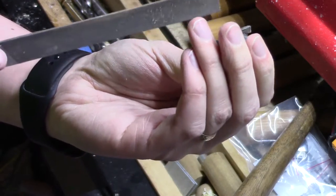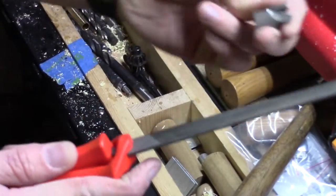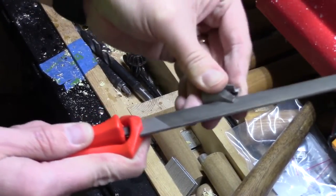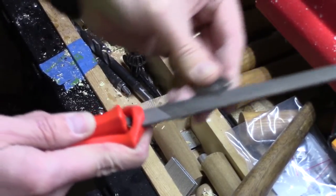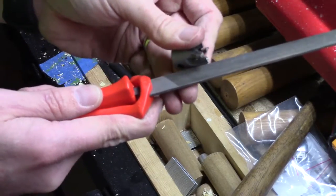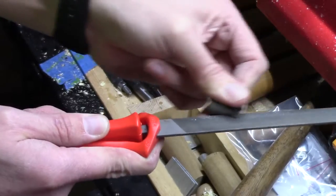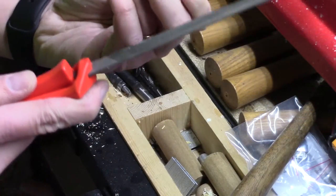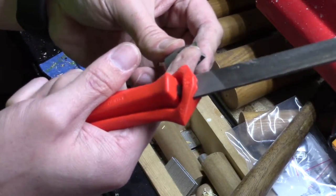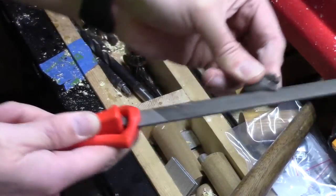You'll see it getting shiny. Now if it's used a lot, you'll see the crud coming off of it. Just move to the next one and keep moving around your barrel trimmer until you get all four sides. If yours is not that dirty like mine is, what you can do is get a sharpie or some kind of marker and put a mark on it — that way you can see where you're filing off.